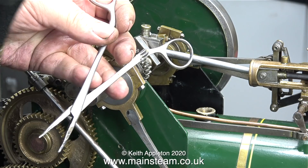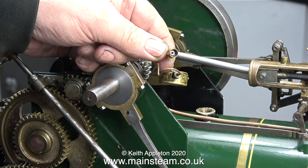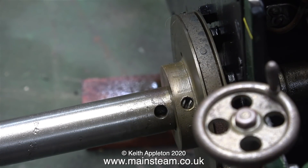I removed it completely using a pair of surgical forceps like these. Finally, here is the pressure gauge with its siphon - it's a very weedy looking thing but it will work okay. With a bit of sealant on the union nut, the pressure gauge is fastened to the bulkhead. That's small but essential job number one out of the way.